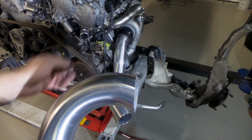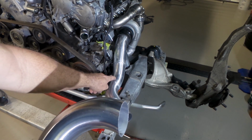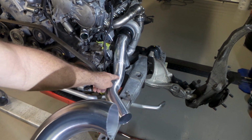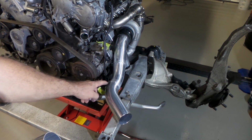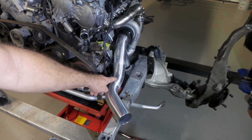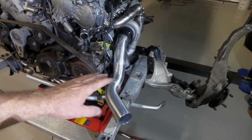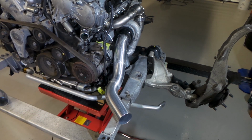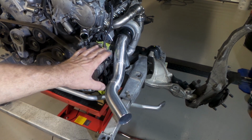It looks a little tiny bit off. These here have been done that way. I had that issue with this pipe here on this join. This one was a little bit bigger than where this section ran into it because it had been stretched in the middle of the Mandrel bend. But it turned out alright. It's just a little bit tricky when you're welding it. But yeah, you get the idea, guys. So that side's pretty good.